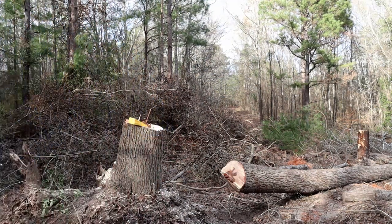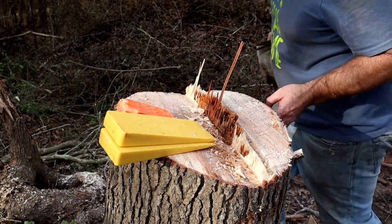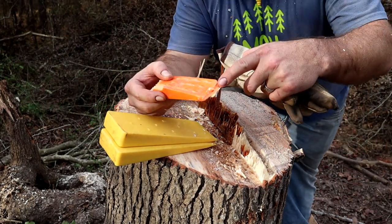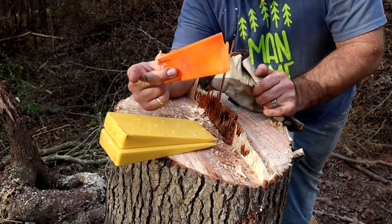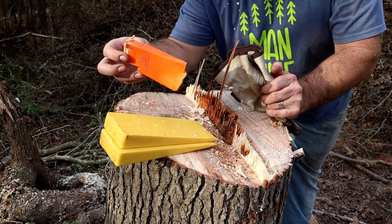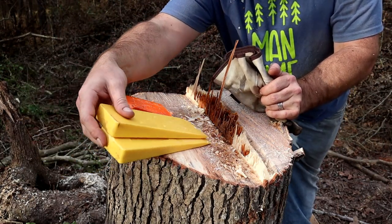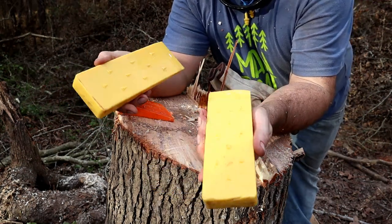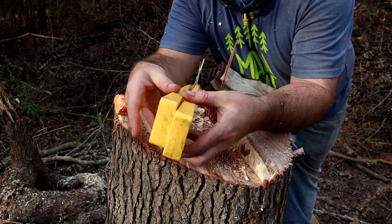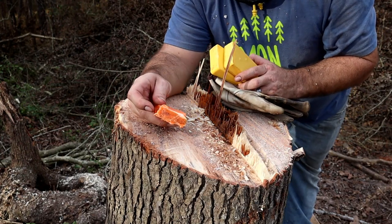Let's look at our holding material here, see how much we had left, and the situation up here with the wedges. Okay, so right here is where I left it. Man, this wedge, holy smokes. I actually had to cut a little bit of it with my saw. That's why I carry these small wedges, because when you're all the way in here and you need to make another move, they're cheap, they're sacrificial, but they're short, so smaller trees like this, they actually work really well. But these work really well too. They're just a little bit bigger. And when you use two of them like that, you can see they've got a side with these serrated teeth on it, and then they've got a flat side. So you can put the flat sides together to go two at a time. But it looks like I need to order some more of these guys. That thing is taking a beating.